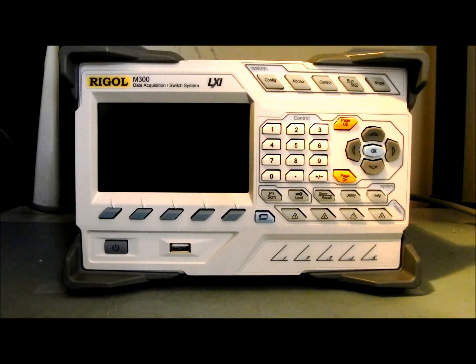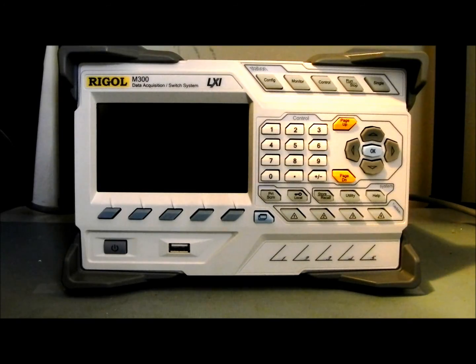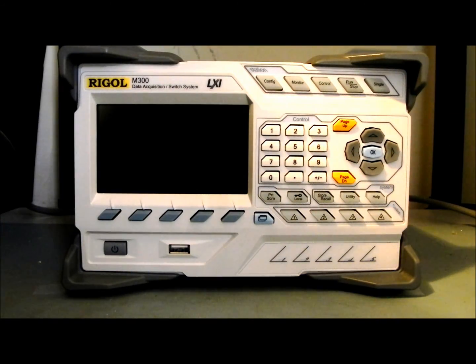You can also use an external digital multimeter. If you don't want to fill a slot with the DMM module, or you have a higher-precision digital multimeter you'd like to use, you can route that into the backplane externally. I can show you those connections when we spin the instrument around. There are also four alarms available on each channel — if you set a high or low measurement limit, you can trigger an alarm through the digital IO to control external circuitry, light a light, or sound an alarm if one of those limits is tripped. You can also monitor channels in a scan list.